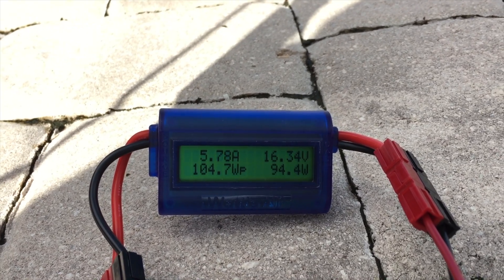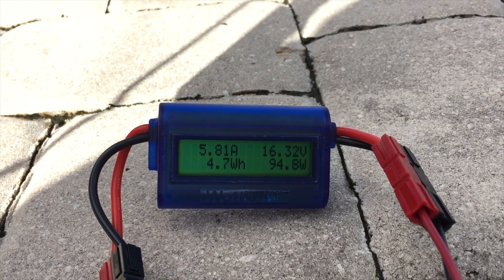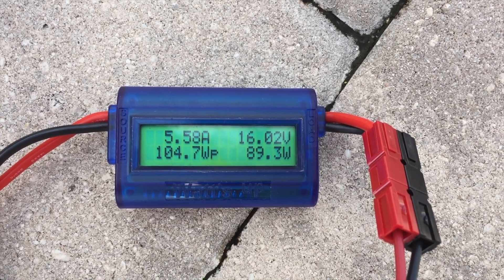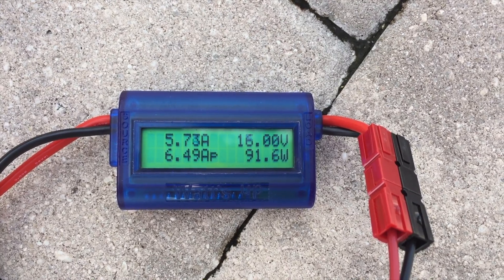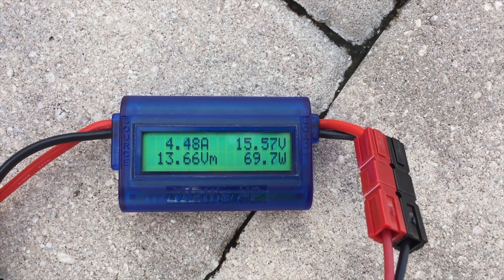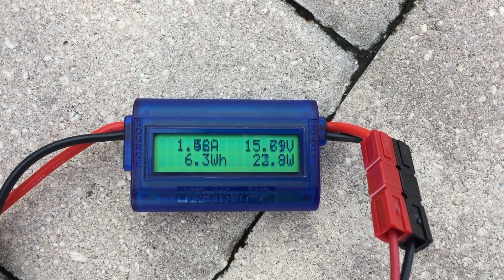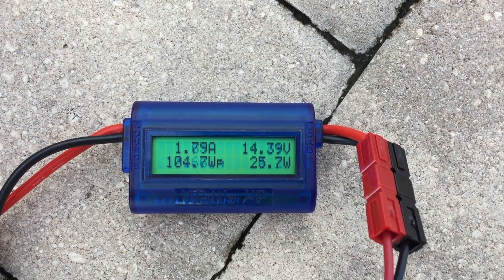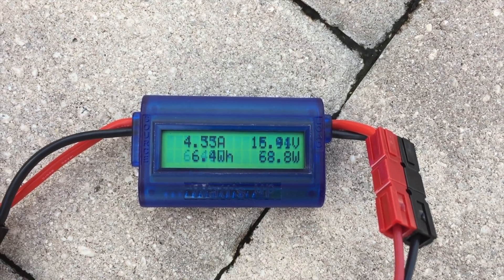In the next clip you're going to see some shading effects and MPPT kicking in to help with that. You'll see the shade come into view, and the MPPT controller kicking in during that shading scenario. There's a significant drop but it's still maintaining above 20 watts, which is not bad in some shade. For a small application like this, MPPT controllers are especially useful when you're out and about and want maximum throughput.